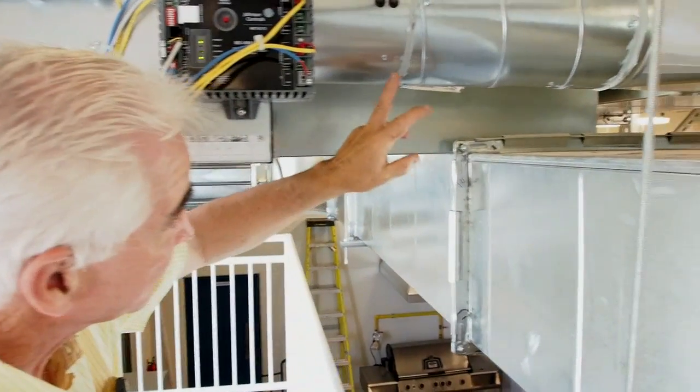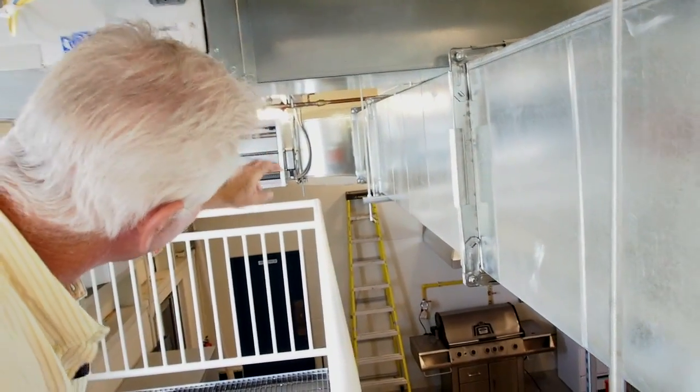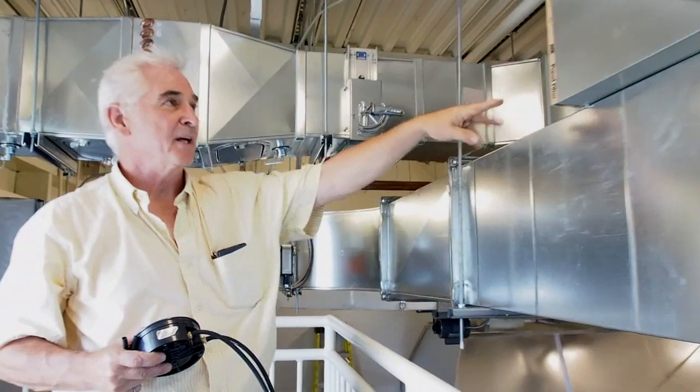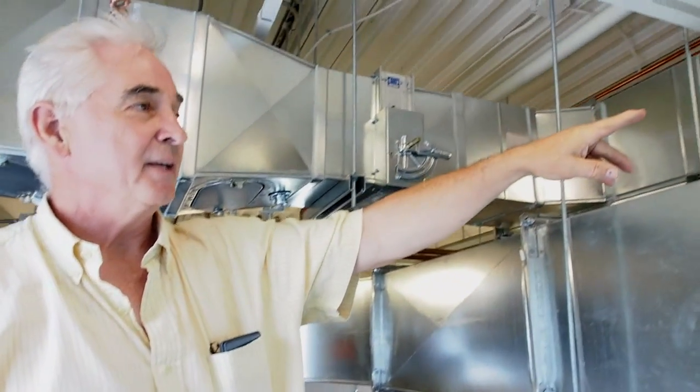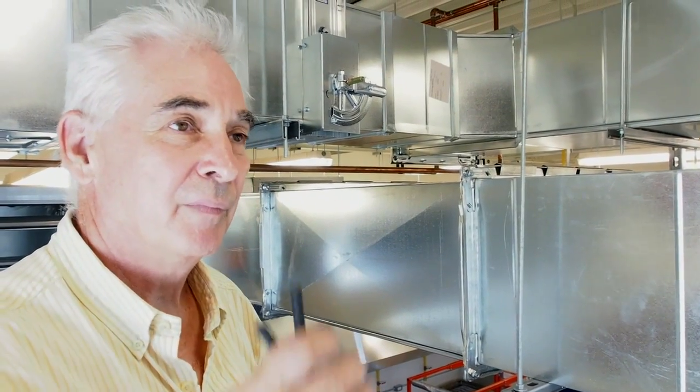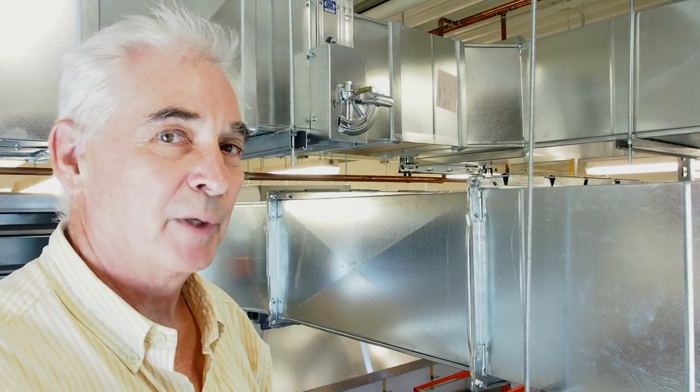The primary air is variable, and the air that doesn't come in as primary air comes in through this return air chamber, which has a filter on it. We never measure that — it's just something to be aware of. For example, the fan may handle a thousand CFM, and the primary air may range from 300 to a thousand, so somewhere between 700 and nothing goes through the return air chamber depending on the primary. We just confirm the building automation system's calibration of the flow station.